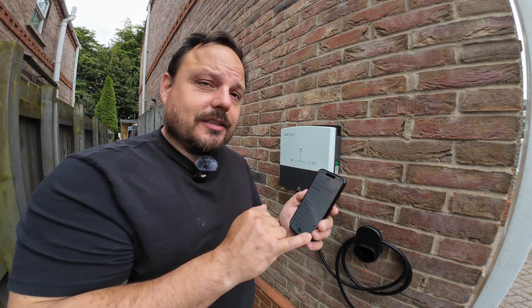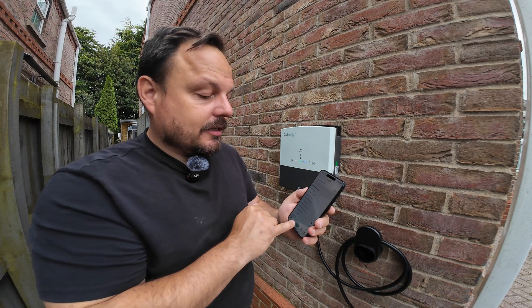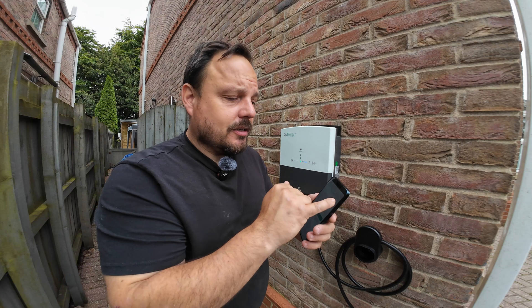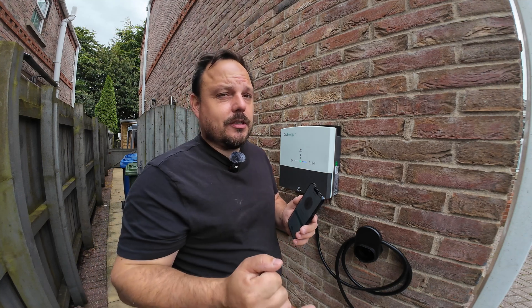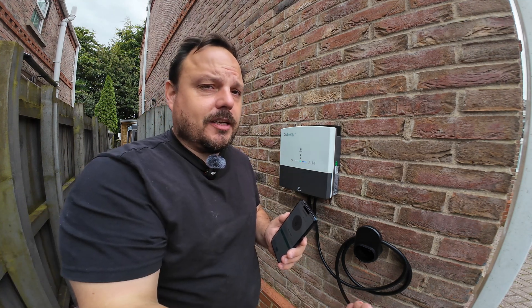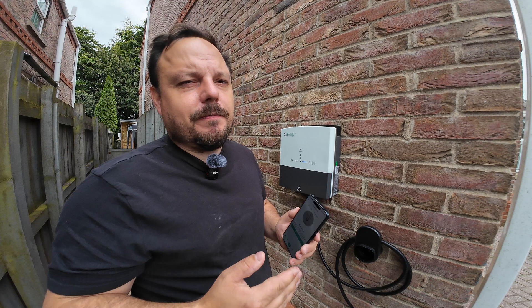As it's currently set, we've gone into solar mode, so if I leave the van plugged in it will wait until there's more than 1.4kW of export and then it will start to make use of that into the van. I've also got it set so solar priority goes to my house battery, so it won't do that until the house battery is full. You can swing that around the other way — if you want to leave your battery in the house not taking the solar and put it into your vehicle, you can do that all from within the app. So we've got our solar mode, a hybrid state which blends a bit of grid, we've prioritized solar to the battery in the house, and we're preventing the battery discharging to the EV — that's the important one. There are loads more of these settings available in the main portal if you prefer a web browser, but the functionality and control is there in the app.